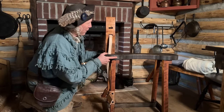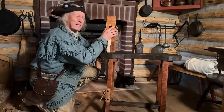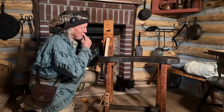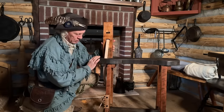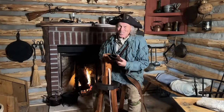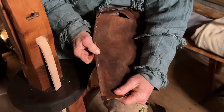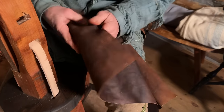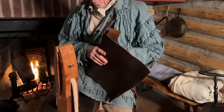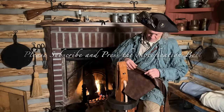That's going to work just fine — all the years of sewing freehand are over. I should note: when I first put the slot in I put it up high, which gave a nice tight pinch in the vise but didn't leave enough space to put leather through, so I added a couple more slots further down. I may even need a third, but I have enough space for the project I'm currently working on. The tension and quality of the stitching is just perfect — consistent tension, and the welt on the inside turned out absolutely perfect. I'm pretty pleased with my new tool. I like old tools, so I'm going to use it a lot, and someday it will be old — hopefully I can pass it on to somebody.